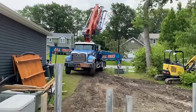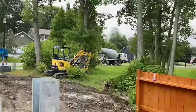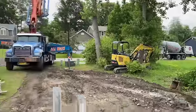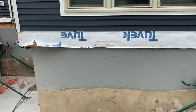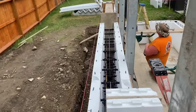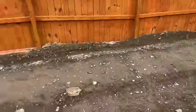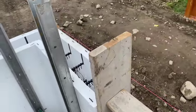All right, guys, we got Always Pumping here because the conveyor truck is broken for Circle T. We got Circle T over there, 315-963-2231. Gonna pump this little box block wall here. I showed you how we build it. We are getting all things set up here. We got like 9.5 yards of concrete. We got our string line down through there. Chris is gauging it with a 1.5-inch block, getting it close. You're gonna probably fill this up to the bottom of the windows first and let that set up a little bit, and then finish off pouring it.